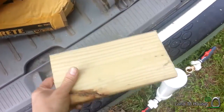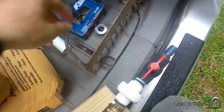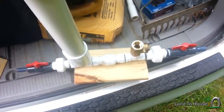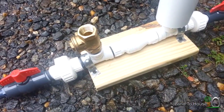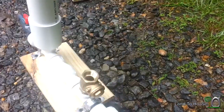Between rainstorms I was thinking: how am I going to get this ram pump to stand straight up and down? Because if it's leaning any, the pressure tank will fill and the efficiency is reduced. So I thought, hey, I've got a decking board in the back of the car — it's right at 10 inches. What I'm going to do is use this as my platform and use some plumber's tape to make this unit stand straight up and down on a base. Basically just makes a little platform here using regular screws, a decking board, and some plumber's tape, and just kits it so it'll stay upright.